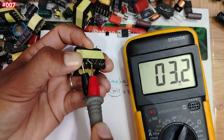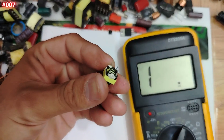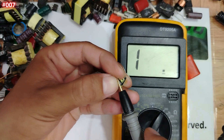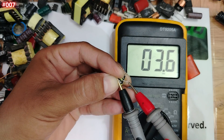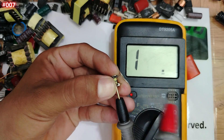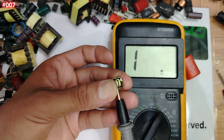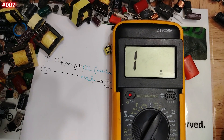Between coils we get resistance — about 2 ohm. Now let's check this smaller transformer with one coil in the input and one in the output. Using the ohm option: one probe on the input pin gives about 3 ohm — good. The other coil between its two pins gives about 4.3 ohm. And between input and output we should get open loop — nothing. Good transformer confirmed.